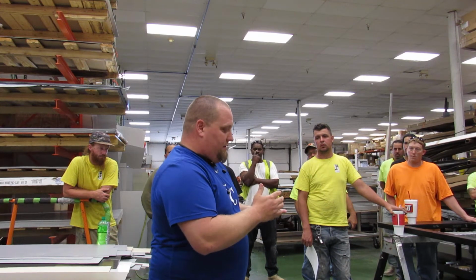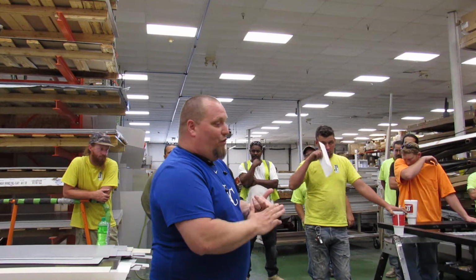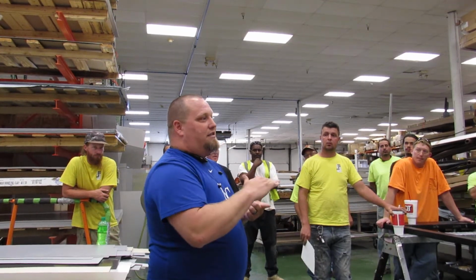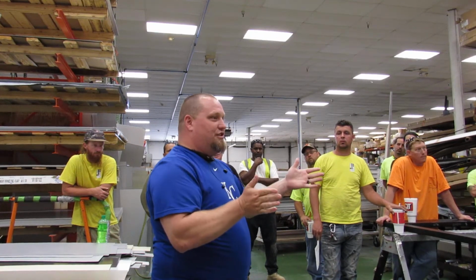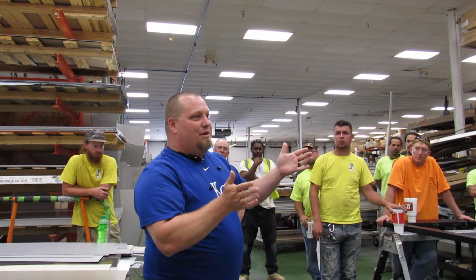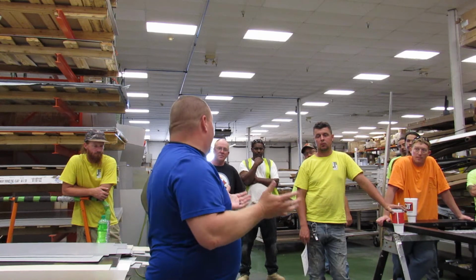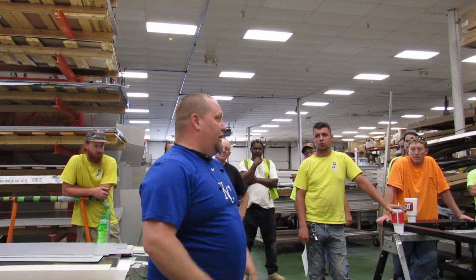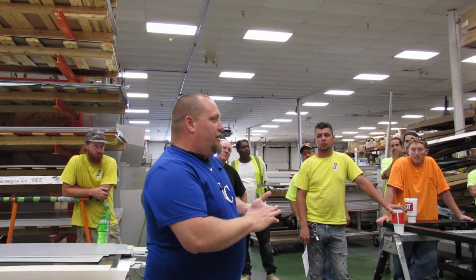Those are the couple examples that I have. Number one, we can never put flashing in flat or at a negative slope. Flat is just as bad once you get past 4 or 5 inches, because over time it's going to find a low spot in that flashing. I mean, it's just going to. There is going to be a low spot in an 040 metal that's running there, or even the substrate that you're running with.